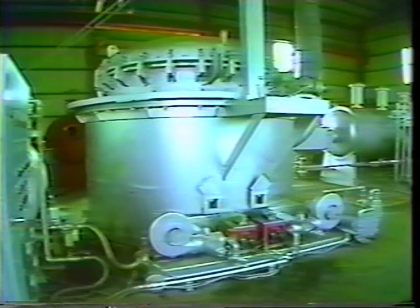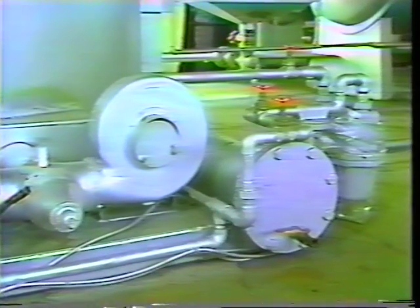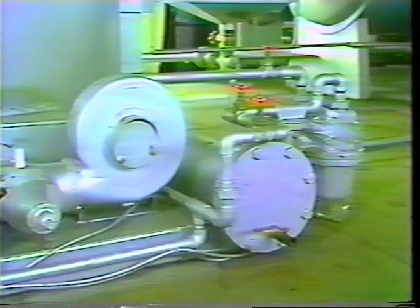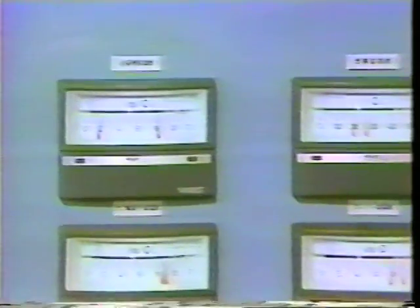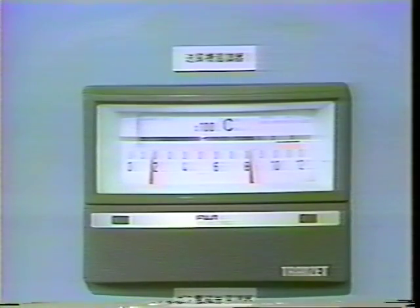At the point when flammable gases are generated, the blower begins running automatically. Ethane or butane gas is also used with a heat combustion burner. However, after the operation is finished, these gases are used to cool the vacuum kiln. At the point when the temperature of the combustion chamber reaches 200 degrees centigrade, the blower stops automatically.